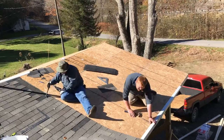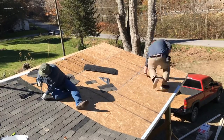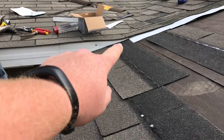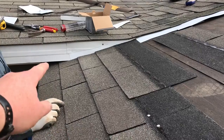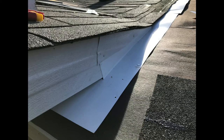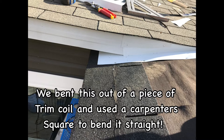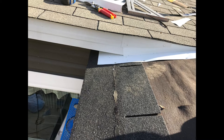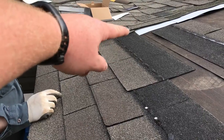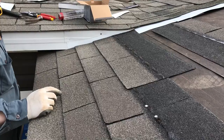While he's doing that, I start putting the drip edge on — you can see that on the lower right of the screen. We end up making a piece of flashing to tuck up under the hip where that valley comes down, and we had to cut a shingle to fit up under that edge. It runs down over top of the starter strip. If any water makes it through, we'll also silicone that whole groove against the flashing. From then on out, you're just laying shingles regular.